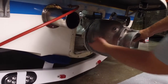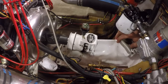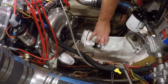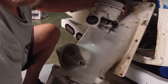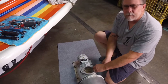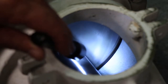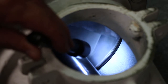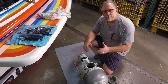It worked out really pretty easy in this case — it came right off the flange. Now we just need to wiggle it off of the drive shaft assembly. This one also has a loader in it, so the loader's kind of hanging up on the pump a little bit. We've got our pump loose now; it's just a matter of getting it out the back of the boat. Now we've got it out. Let's pull the handhold cover off and see if we can see what's rattling inside — I'm thinking it's possibly the wear ring come loose, or maybe it sucked the insulator out. Now with the handhold cover off and spinning the shaft, you can hear the wear ring rattling around. Looks like what happened is it pulled the insulator out, so the wear ring is no longer held in place — which is just no bueno. Now that we know what the problem is, we're going to get this up on the bench, get it apart, and get it taken care of. Keep following this project on PowerBoatOne.com.